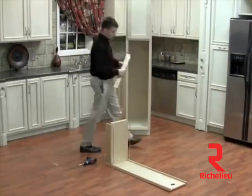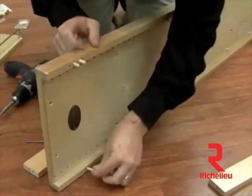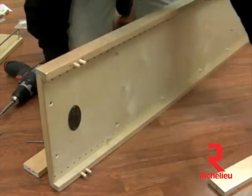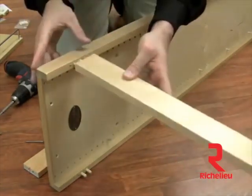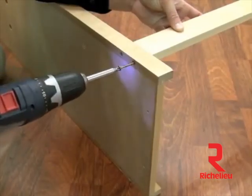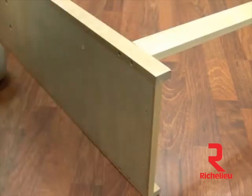Next I'm going to grab our two wood rails and we will begin by installing the supplied dowels. Then we will place these right into the back panel. Then we'll take four of our number 8x2 screws and we'll secure the rails.